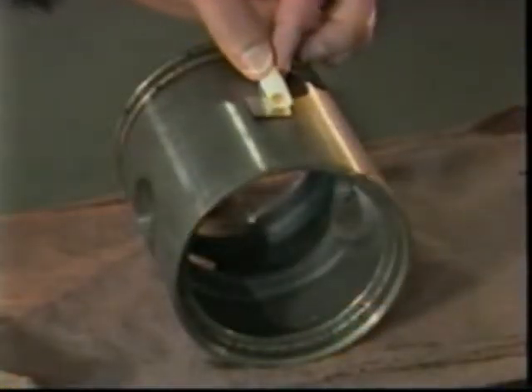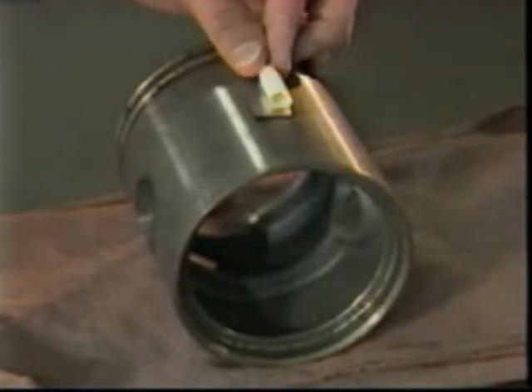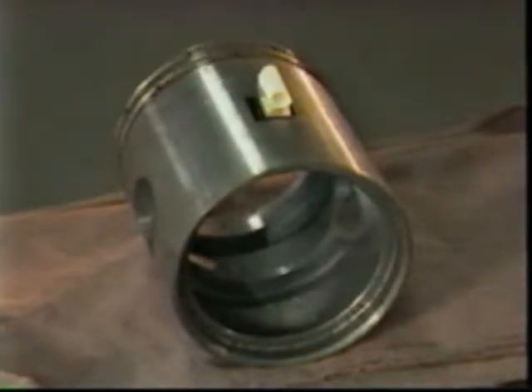They are applied defect side down to prevent possible particle buildup within the flaw with repeated use, and can therefore be used over and over again. They may be held on the surface of the part by hand, held down by their edges using scotch tape, or pasted onto the part using superglue for repeated tests.